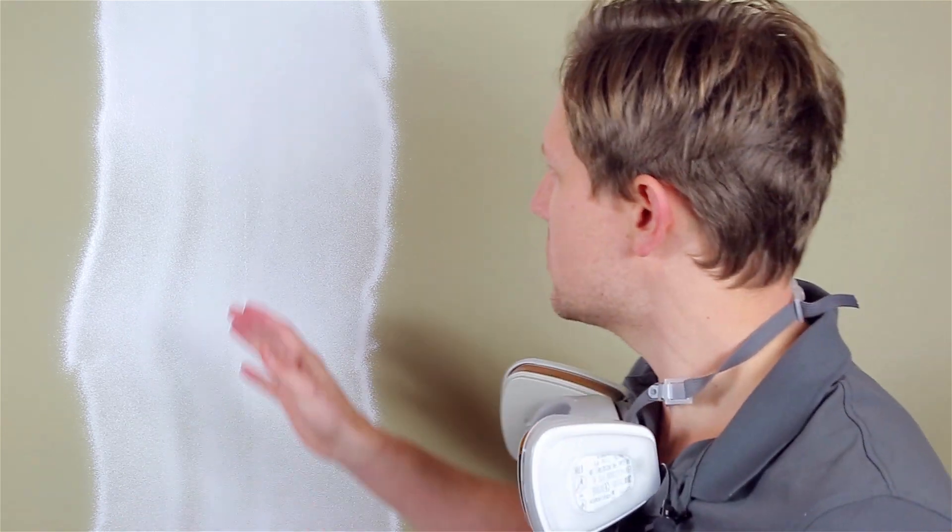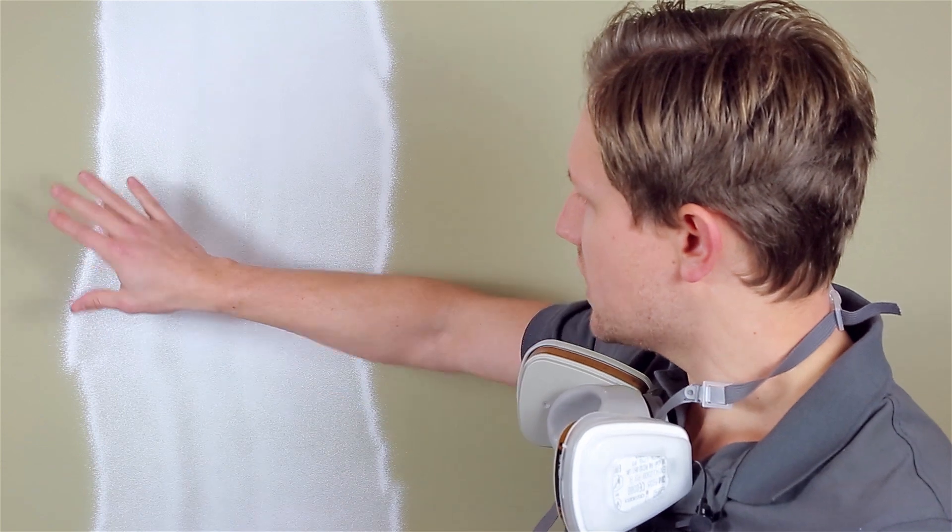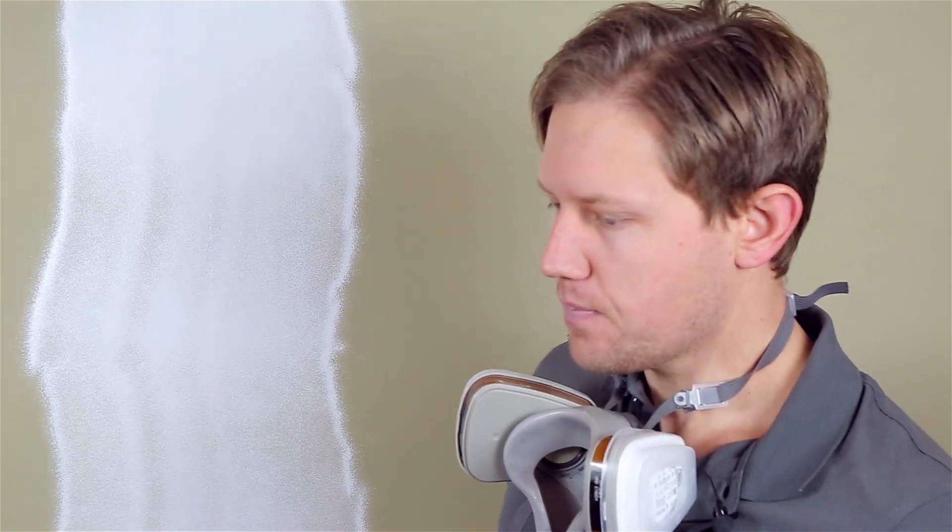So how do we solve this? If your spray tip is worn, simply replace the spray tip. If there's not enough spray pressure, you're going to want to gradually increase the pressure until you start noticing that the tails are disappearing. You may also be able to thin the material that you're using, if that's possible.